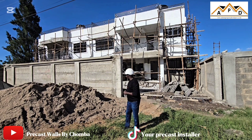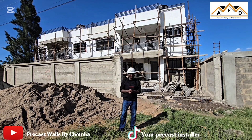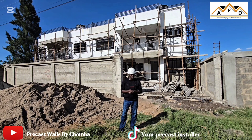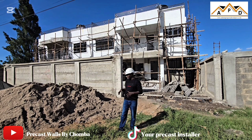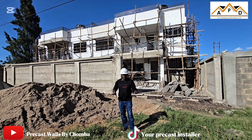Nonetheless, this is where we are. Just a highlight of what we did on this project: we did a suspended slab, mainly because the depth of the murram was almost more than three meters, and also the land was very sloppy. We dug the trenches, we dug the pits, we did the columns, the ring beam, and then we installed the T-beams and blocks on the foundation.